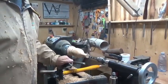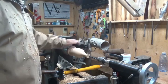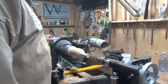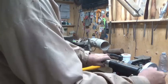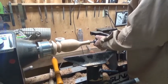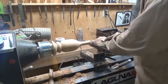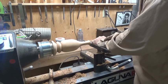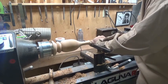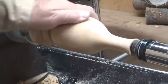Now I'm going to drill the top, then do some final shaping and sanding before we seal it using the Canadian Superior Grit and Hampshire Sheen finish. We're going to bring the speed down slower. I decided to thin this neck just a little bit more, so I put some tail stock support to reduce vibration.